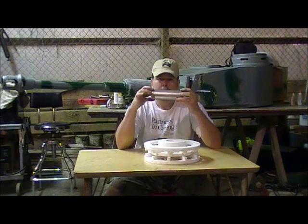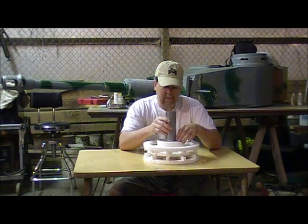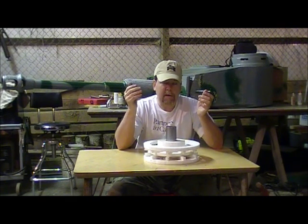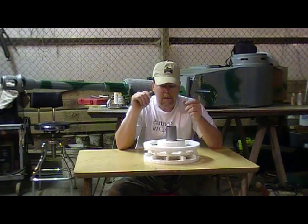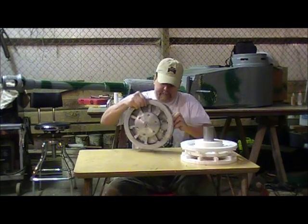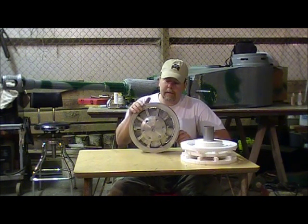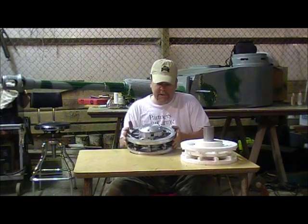The two-inch, two-and-a-quarter-inch OD exhaust pipe I use is to make sure that I get an absolutely smooth hole when the casting is completed, and it makes minimal effort as far as milling for the bearing face. So basically we're going to try to turn this into this — this is what they look like after I've had some machining done and cleaned it up.